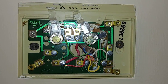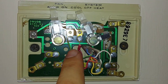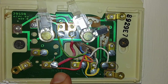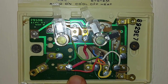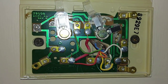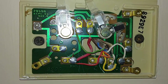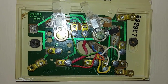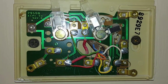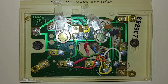There are two screws here that mount into the wall — we're going to be removing both of them. We'll take each of these wires out from their location, noting how they're labeled and what they correspond to. You need to pay close attention, because you'll reconnect your Nest thermostat in the identical fashion. The Nest box includes labels for the wires, which you can put on the wires before disconnecting them so you don't forget. It's also a great idea to take a picture of this thermostat just in case a sticker falls off or you get confused. So I'm going to start removing those screws and removing the wires, then remove the back plate and begin the Nest installation.